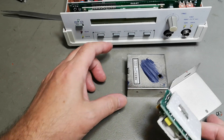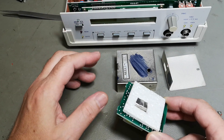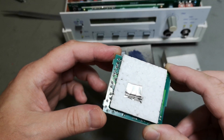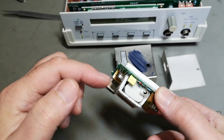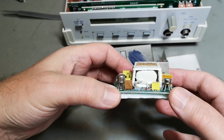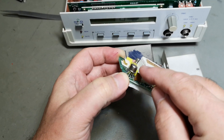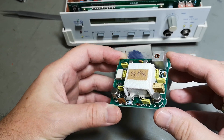Normally nobody opens a working oven-controlled oscillator — please don't do this at home; I'm a professional. Here's the bottom side with a nice flexible ground connection to the chassis at the crystal. Inside the potted compartment we have a crystal, a heater, and a temperature sensor, all connected very well together — electrically and thermally shielded. Isn't that just lovely?